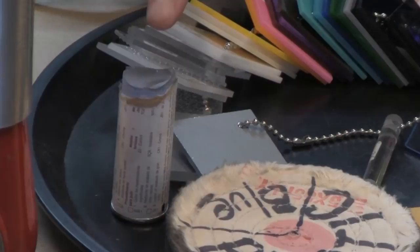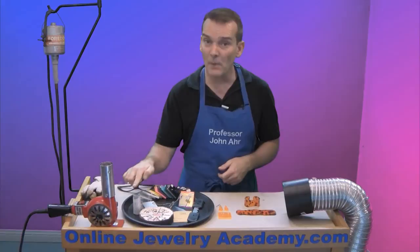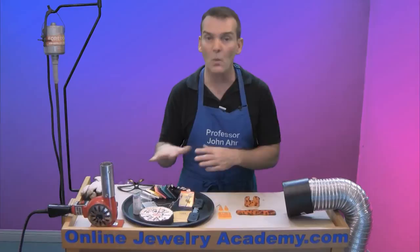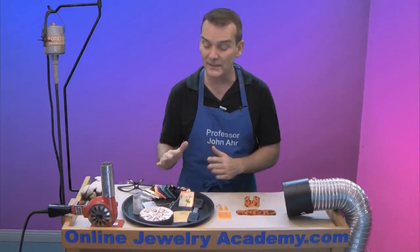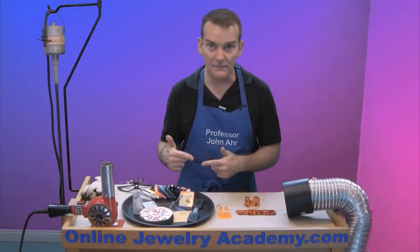This material can be cut, shaped, and polished, but you're going to need a special polish for this — a special plastic polish. You want to keep this polish separate from your other polishes and put it in a container that's closed. You don't want to contaminate it. Same thing with the muslin buff that you use with the polish — you want to keep it very, very clean. You don't want any grit getting onto it and causing a scratch on your plastic surface.